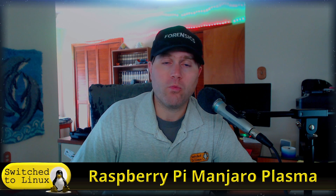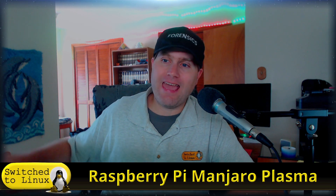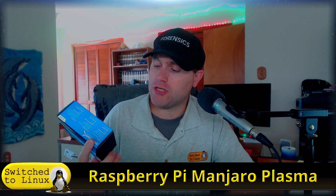Eventually this is going to have a hard drive on it. The hard drive runs between 700 milliamps and 0.9 amps, so you're not going to be able to run that off the basic power supply. Having the external USB hub with its own power might mean I can run both the Pi and the hard drive off of it, though this hub is likely only pushing 2.5 amps as well, so I'll have to test that.